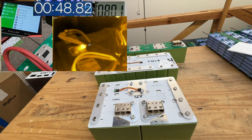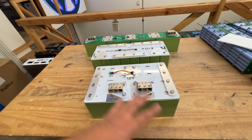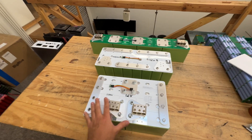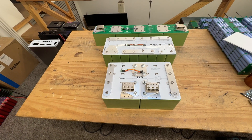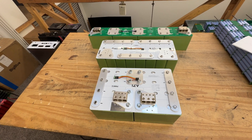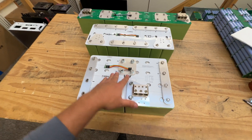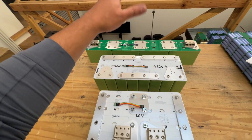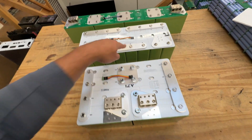I'll link the test in the description of this video. All of these are basically the same batteries just in different shapes: eight cells over there in a 4S2P configuration. People are putting these in cars for very high-power audio applications because you have real size constraints — tight spaces. That's why I made the different shapes: maybe you can't fit this one in your car but you can fit this one, or vice versa. A lot of people are putting the slim one behind their seats because it's long and skinny. So that's why they're called Slim, Long, and Fat — just the easiest way to identify them.